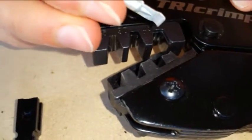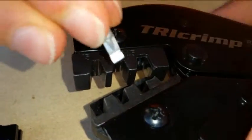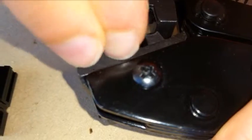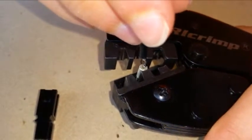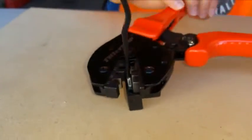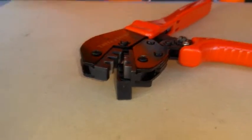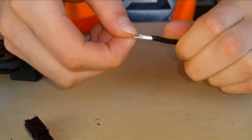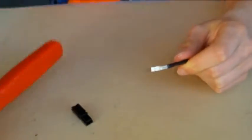When you're putting the metal part in, you want to make sure that the little hook right here is facing downward. So when I put it in here, make sure it's facing down. Now we'll put the wire in — into the hole — and make sure it's all the way in with no metal exposed. Then we'll ratchet it down. Sometimes it can be hard. Once it releases, that means you're done. Give it a little tug to see if it comes off at all, just to check.